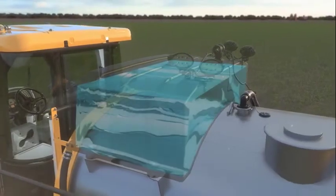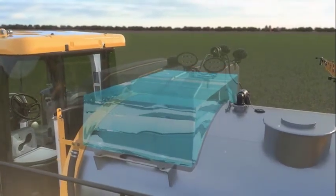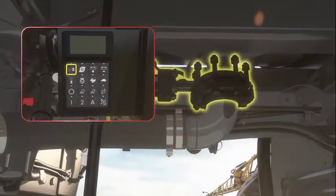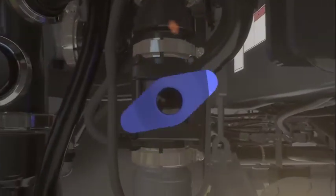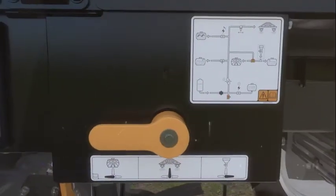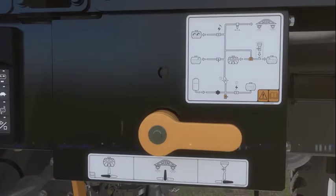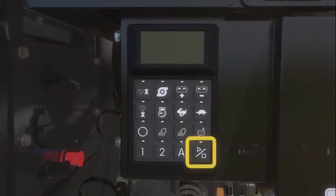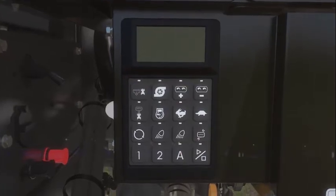This rinse should run for approximately 1/3 of the volume of the rinse tank. Next, open the sump valve. Close the freshwater rinse valve. Open the bypass. Open the agitation valve. And move the 3-way valve to the eductor if the machine has one. After the tank rinse is complete, simply cancel it on the keypad or proceed to the next step.